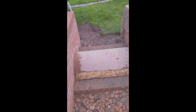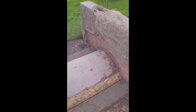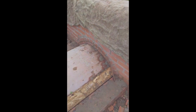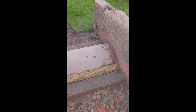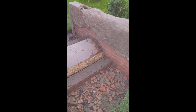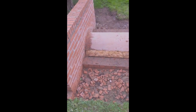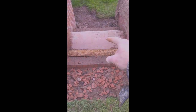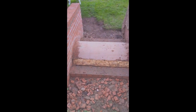The first layer is going to be about four inches deep and it should go to the top of the bricks at the top of the archway. Then the next layer will be about two or three inches, and then finally another inch or two of another layer of concrete as well, just layering it up. It's only a small amount of distance. And then I want to add a load of soil to just build up the levels and put it on top of the bricks on both sides, smooth it over and try to get the levels a bit smoother so you don't notice such a big hump in the middle. And it will tie in both sides of the garden a bit better that way.